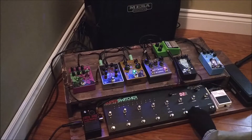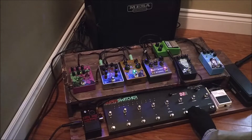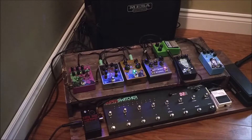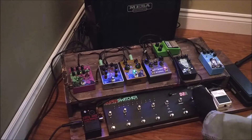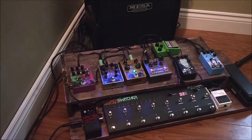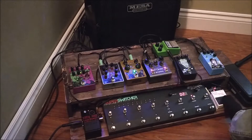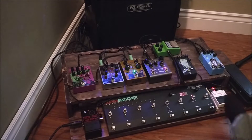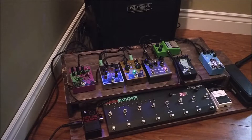There's one tap out; I'm not actually using it — the only one I use tap tempo on is the Kaptivator, and I just set it manually. The tuner button mutes everything and sends the input to your tuner. Here I have my Boss TU-3 chromatic tuner. The tuner button will work even if you don't have a tuner plugged in, so it's kind of a convenient mute switch as well.